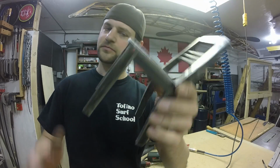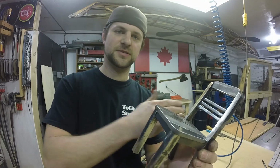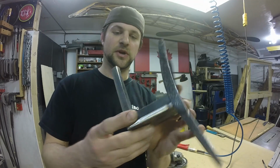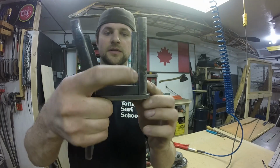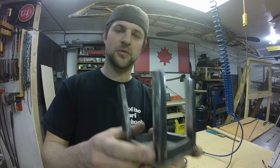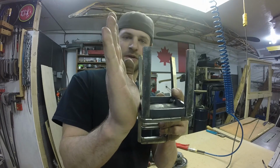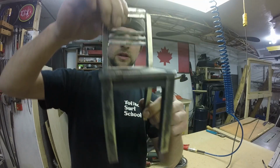3/16 steel. In a project like this, it's all pretty straightforward stuff. You're just cutting the piece, scaling it, and replicating it in steel. Biggest challenge here is probably the weld pulls. Like when you tack this leg down on this side, it's gonna pull it that way. And if you're familiar with welding, that can be a real pain, so something you got to take into account. Maybe like start there, and when you tack it, it'll bring it in. Kind of more of an experience thing, but all in all, it's looking good.